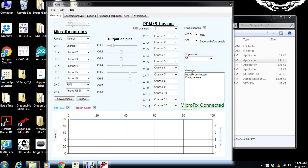You can also verify that you have a different ID. Transmitters typically ship with ID 391, so if you get your transmitter make sure you change the ID to something random — this has to be done from the actual transmitter itself. On the PPM side, you can change it to PPM or SBUS and select however many channels you want the receiver to output through the PPM port.